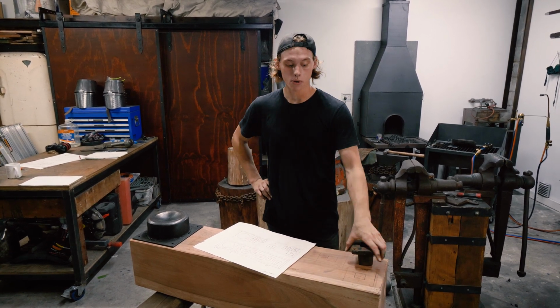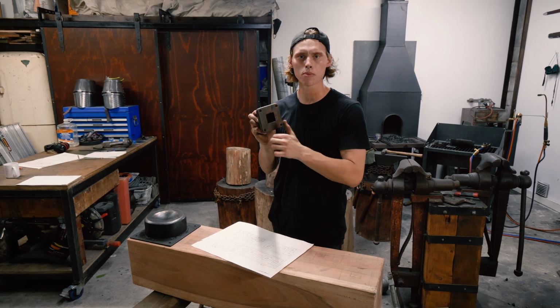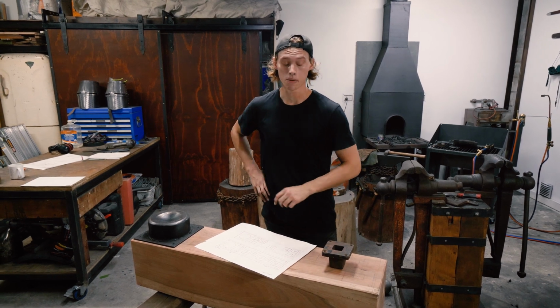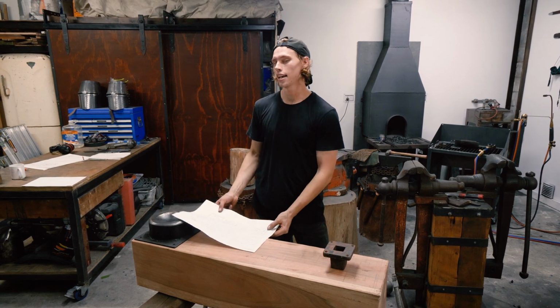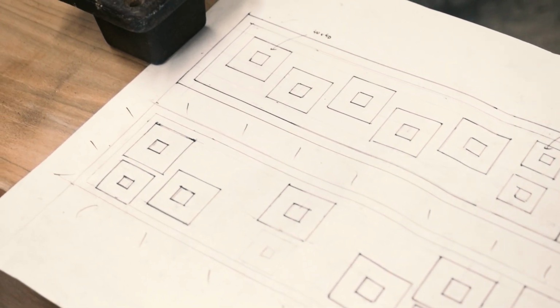That all said, we also have some smaller little stake plates for the smaller diameter tapers. Most of them are a 40 by 40 taper, but some of them are a little bit smaller, around 30 by 30, so we've accounted for that in our design as well. I can work both sides, I have the space I need, and it's laid out in a pretty symmetrical way. So let's get on with chiseling in those holes, and we're only a few steps from finishing off this build.